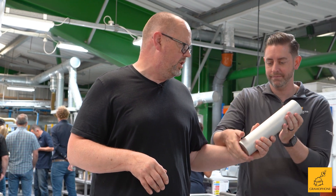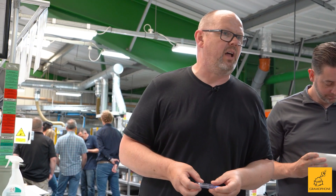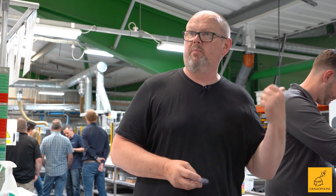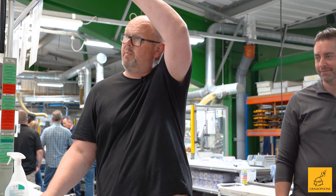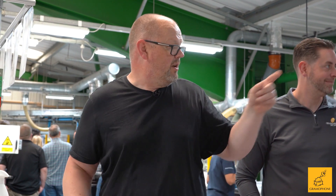That is milled from one of these — this is way heavier than what you just felt. Just to be clear, as I said before, we don't do machining metal on site; that comes to us from a supplier. However, one of my colleagues sourced the billet of metal just to give you a sense of what it actually is. That solid body is cut as a single piece from that billet — there's no welds, there's no joints, there's no solder, there's nothing. That is machined as solid from that.